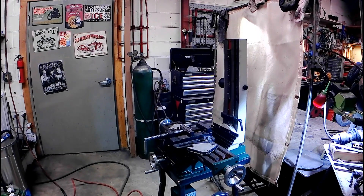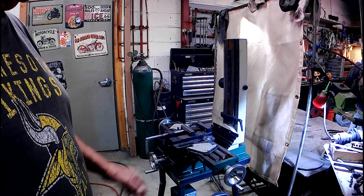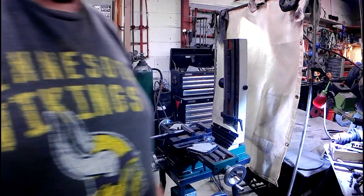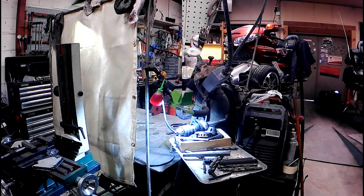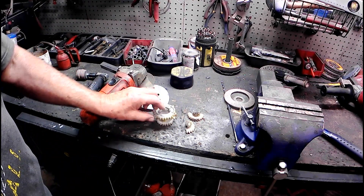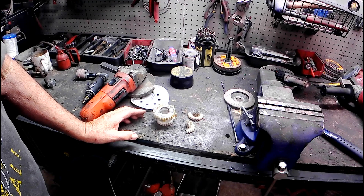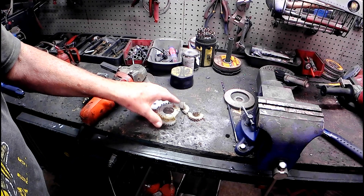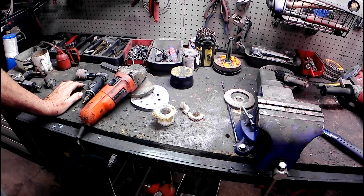A little update on my purchase here — I was pretty impressed with it until just recently when it stopped working. I've got it torn apart with some parts sitting in a little box here. Here is the problem: you take a thousand dollar mill drill, the engineering on it is very good, and then they stick in plastic gears. This one broke in half and sheared a couple teeth off.